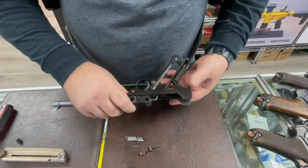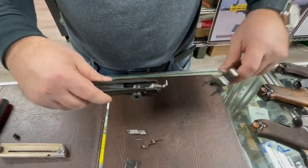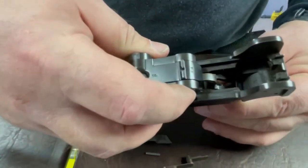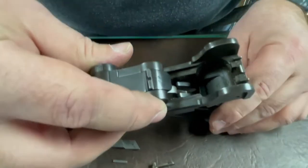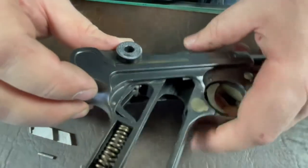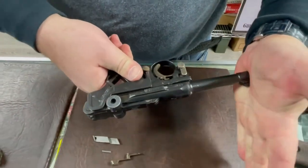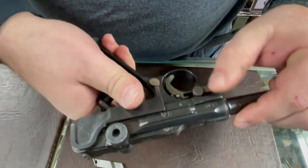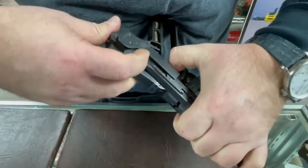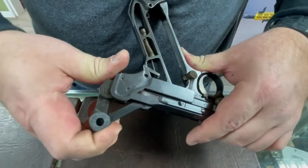To reassemble, take the upper upside down, slide the frame onto it about a quarter of the way, then drop the hook in front of the L-shape to make sure they engage. You can see this engagement from the side where the hook latches onto the lever. Push it down, lock it, and now you can see the interaction of the levers — the L-shaped lever moving, spring compressing — that's the main operation of the toggle.